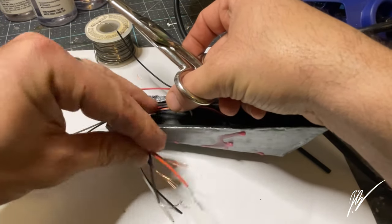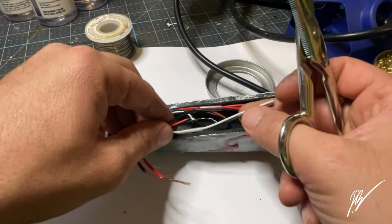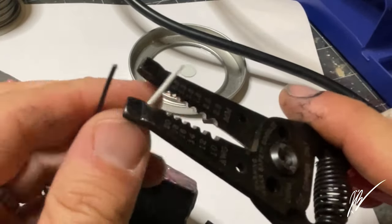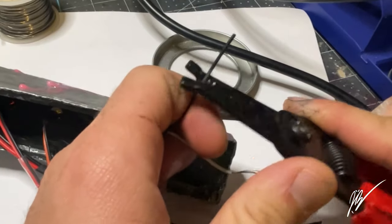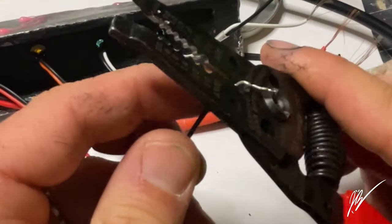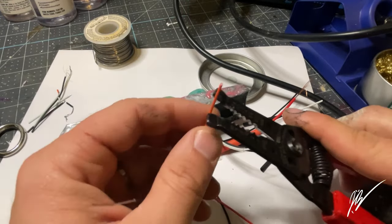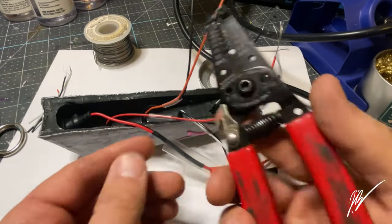Wherever you are, that terminology may be different for wiring people or people who do electrical work. It doesn't really matter. Basically, instead of butting the two ends of the wires together and twisting them so one continues into the other, we're going to butt them all up on the same measurement, and then twist them all together, and it creates a rat tail type of wiring. It is really nice. It's nice, tight, and neat, and you'll see that shortly. As you can see, I'm stripping this away here, getting everything ready for us to do that butt splice.